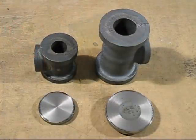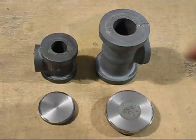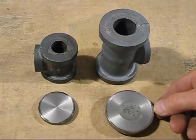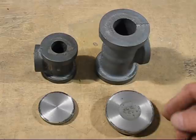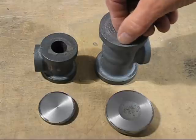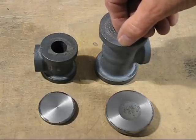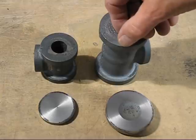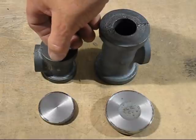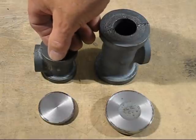As you can see in the previous video clip, these castings were machined, all 4 of them, and boy oh boy, it revealed some horrible problems there. As you can see here, it's very chilled on the edge. So, if I was a gambling man, that edge there, I'd put all my money on it and say that would be chilled as well. But we'll go and have a look at that edge and also this edge as well, and we'll see how badly chilled it is.